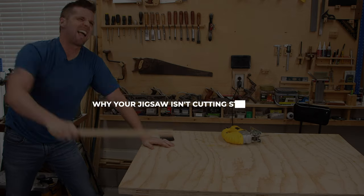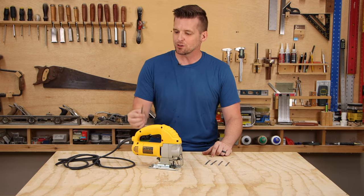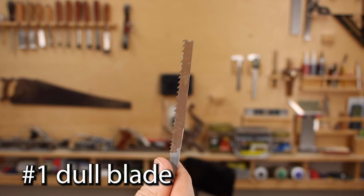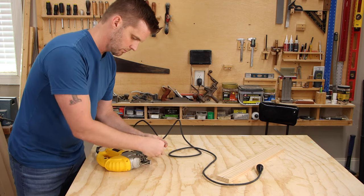The first possible reason you can't get your jigsaw to cut straight is that your blade is ancient and now it's as dull as ever. Blades do not stay sharp forever — the cheap ones don't stay sharp long at all. So this one is easy: throw it out and get a new one.